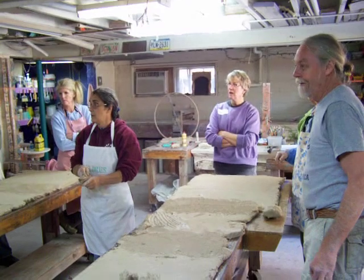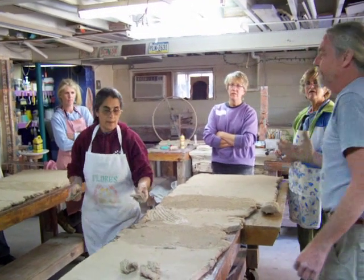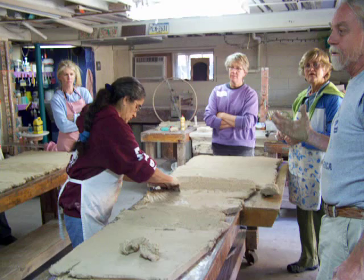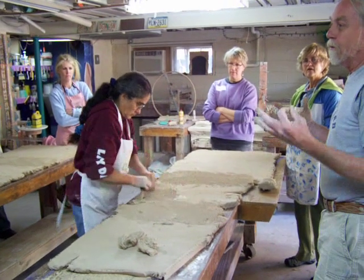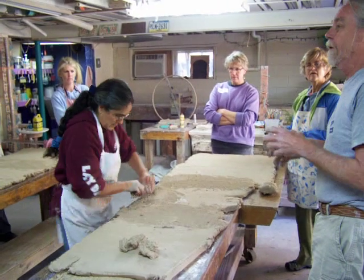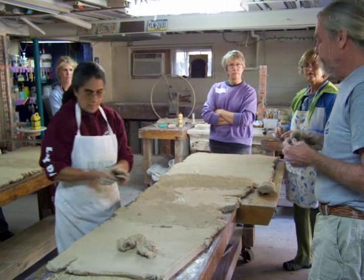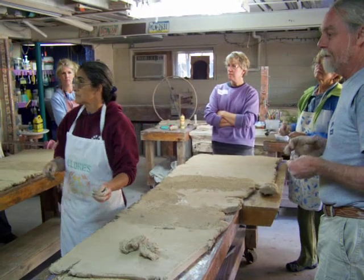She took a cup of sodium silicate and poured it into the bucket — I did that demonstration at the junior college recently and was totally impressed. The idea with casting slip is that if you use regular slip to pour into a slip casting mold, it has so much water that the plaster can never suck it all up. By adding sodium silicate, you get it liquid with much less water volume.